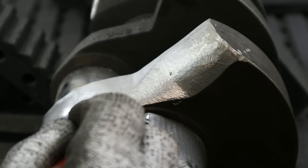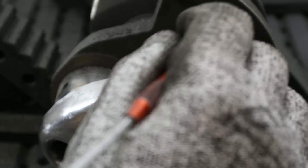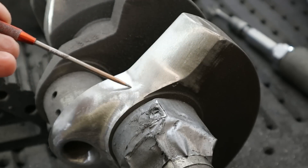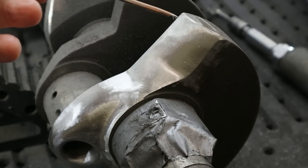You'll notice that I've got this radius continued all down to here and then it blends in here. Try and not get too much of a hump here — this really needs to be slightly concave or flat. Blend it in here and like I said, we're going to dress this edge here. Next I'm going to use the emery roll on this so that you can see the form. Here's the form — fairly much finished. May require a bit of touching up here and there.